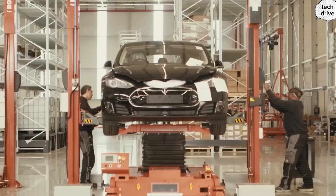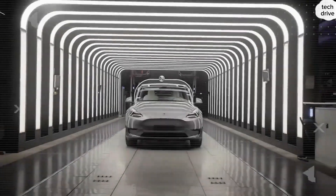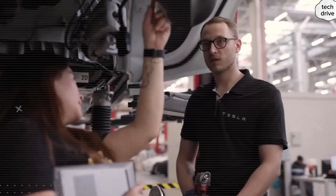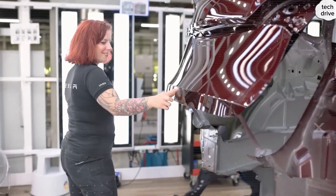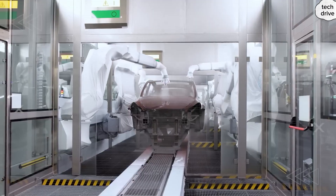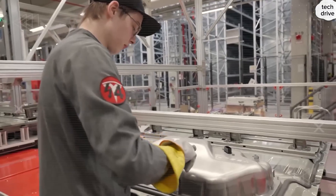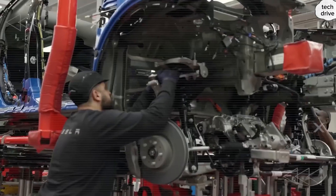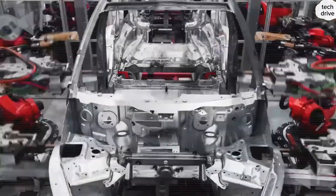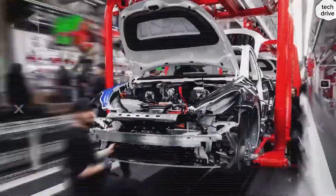Here's the secret sauce: how does Tesla's copy-paste-style factory make the Model 2 even cheaper month after month? Every single month after launch, Tesla can actually make the Model 2 cheaper, not more expensive. Giga Texas isn't built like a fragile, endless conveyor belt. Instead, the factory works like a product that can be copied and pasted. Tesla builds cars in parallel cells that snap together like Lego blocks. Each casting cell has shared utilities and quick-swap dies. So when demand spikes, Tesla doesn't need to redesign the entire building — they just add another cell. That keeps uptime high, downtime low, and output steady.